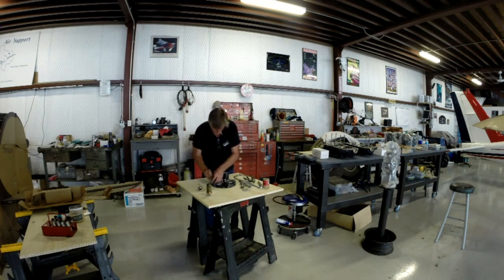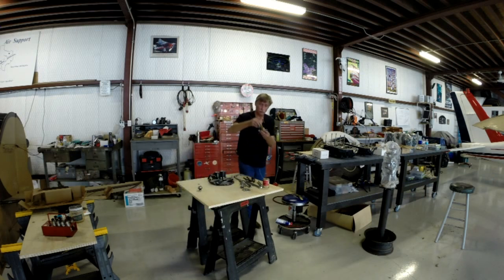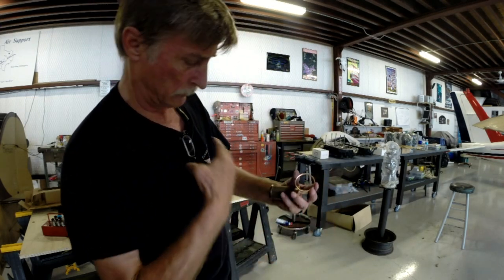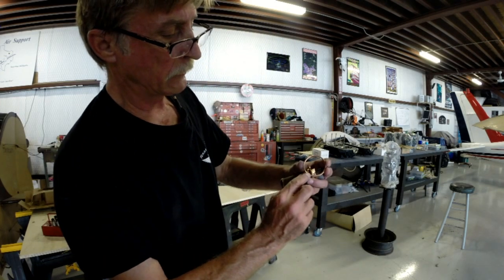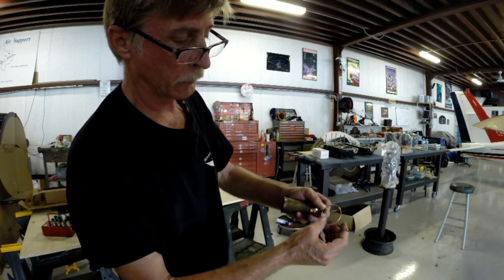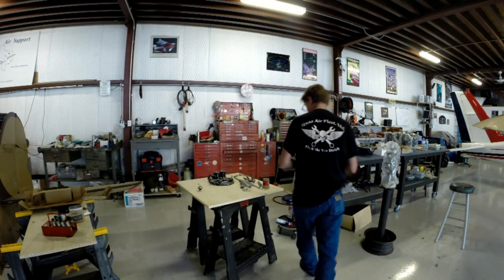This portion has a copper asbestos gasket on it. It's very important that the little seam on the copper asbestos gasket goes towards the case half, not towards the twisting portion. Here is my suction screen — you can see there's a little slit on the back where the asbestos is folded into the copper. The smooth surface goes against the turning surface; the open surface goes against the fixed surface.